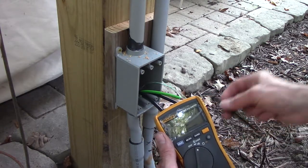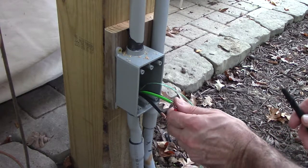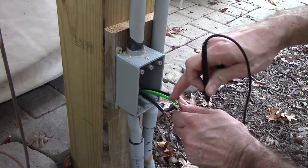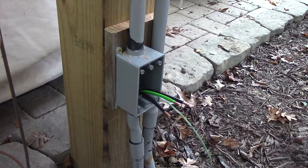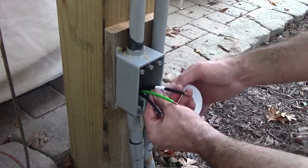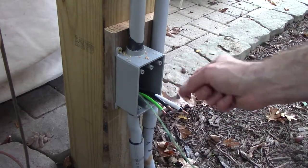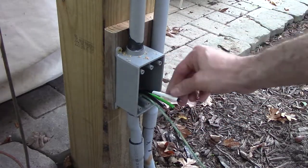See if I tie it to the other wire — we're just checking resistance. So it's obviously not that one. This is the wire that is hooked to the ground under the deck, so we're making a circuit back to the box under the deck back to here. So we'll make this our neutral wire and identify that by taping this wire white. Now we'll go back under the deck — the wire that's hooked up to the neutral, I'll tape that up and then we'll know which one's which and we can make our connections under the deck.